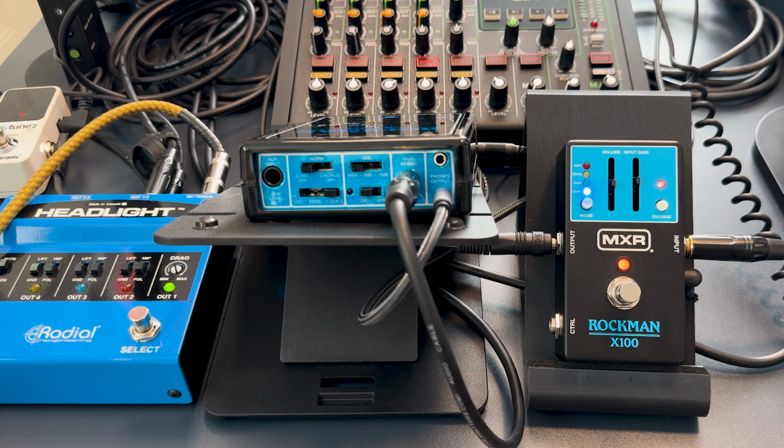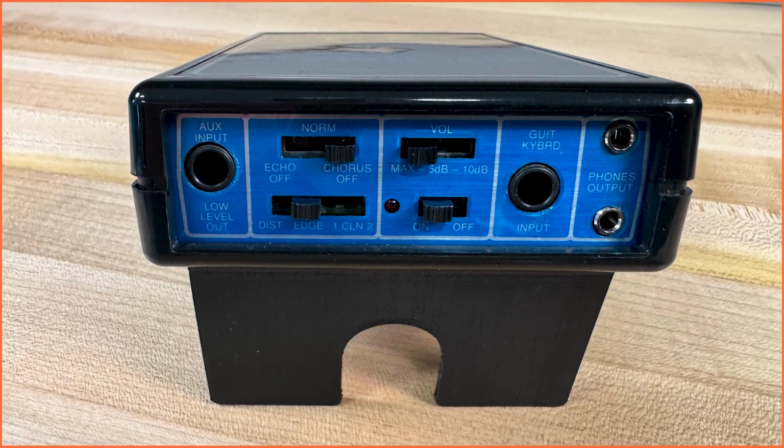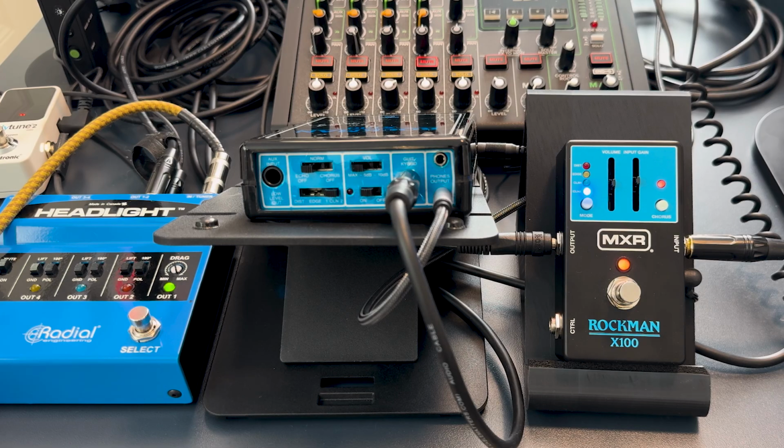And it's still a little bit darker. I've added the 12K hertz from the typical Mackie type EQ and a touch of 2.5K to try to equal them out. Still, the older unit's brighter. My unit has been fully serviced and has new capacitors and everything, so I think it sounds pretty close to the way it would have originally.